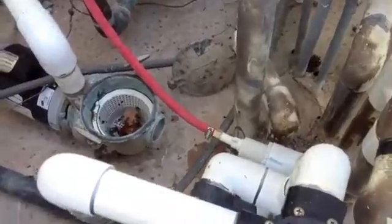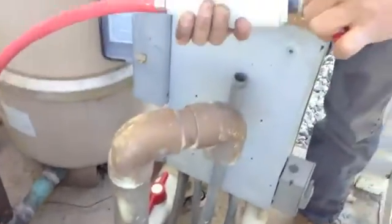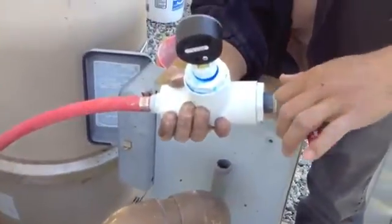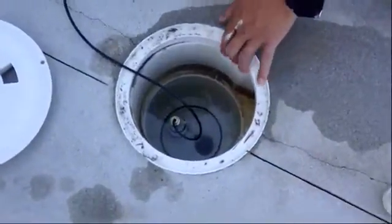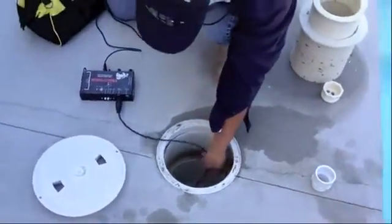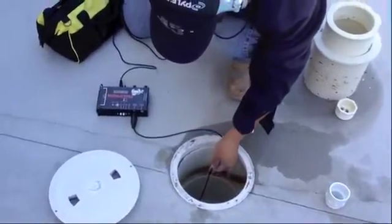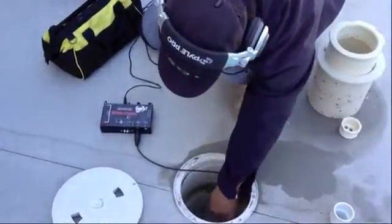Okay, so we pulled the wire back, cut the pipe, and installed our injection rig. We have water hooked up to our injection rig under slight pressure right now. William is tweaking it so he can get it to about six pounds, which is the ideal pressure for our slide mic to work at its optimum. The slide mic is in with the converter, and William's going to pull back until we get right over the sound — we're under six pounds which gives us the optimum sound of the leak.